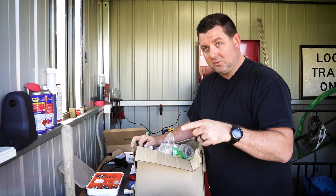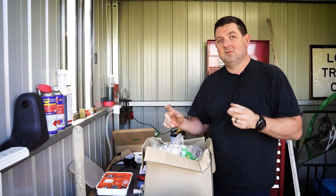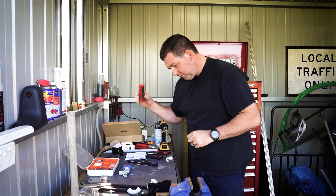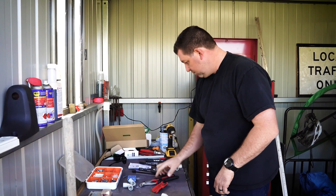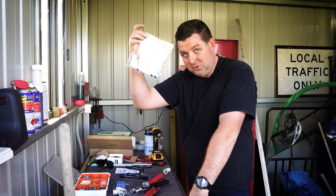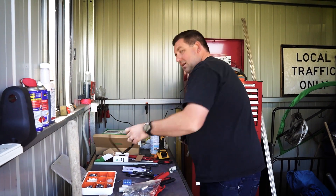I'm going to wire them to the 7-core cable that's in the ground, join them up with the waterproof connectors, and then make a third video of me seeing if it works. What we'll need for this part is wire strippers, multi-grips and/or pliers, waterproof joiners or a soldering kit and heat shrink connectors. The solenoid coils should already be on the valves — mine aren't. I've got these, and the cable is already in the ground. Eye protection as well.